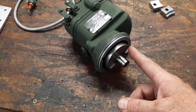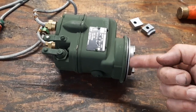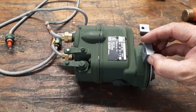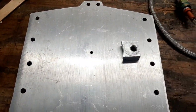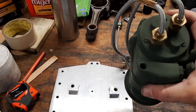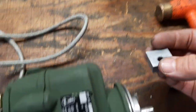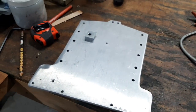Still need to figure out how to fasten that to the crank. But this is the size of hole we need to put right there - it needs to fit in nice and snug so the o-ring will seal up, and then you have these clamps on each side that bolt through the backing plate to hold it in place. They should go on each side like this with the magneto positioned like this, but I'll wait until I've got it timed to see exactly where it's at before I drill the holes, because you don't want to end up with one of the clamps underneath.